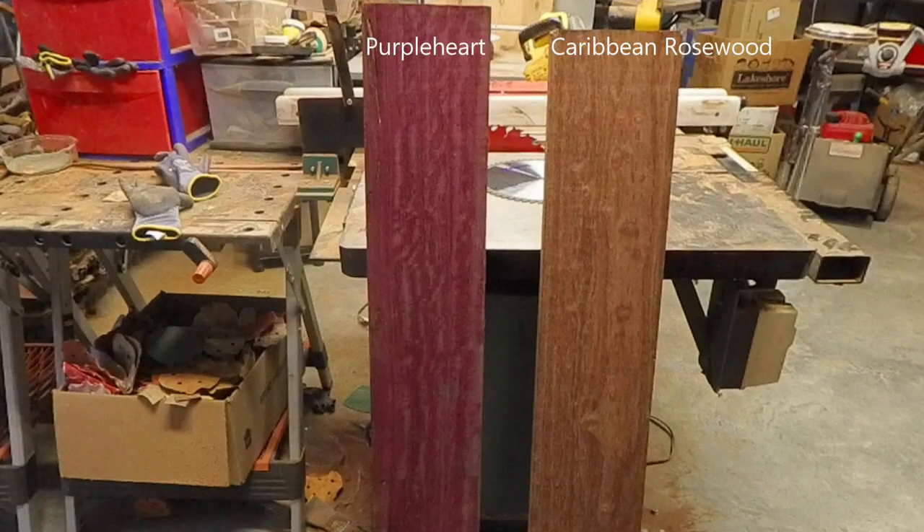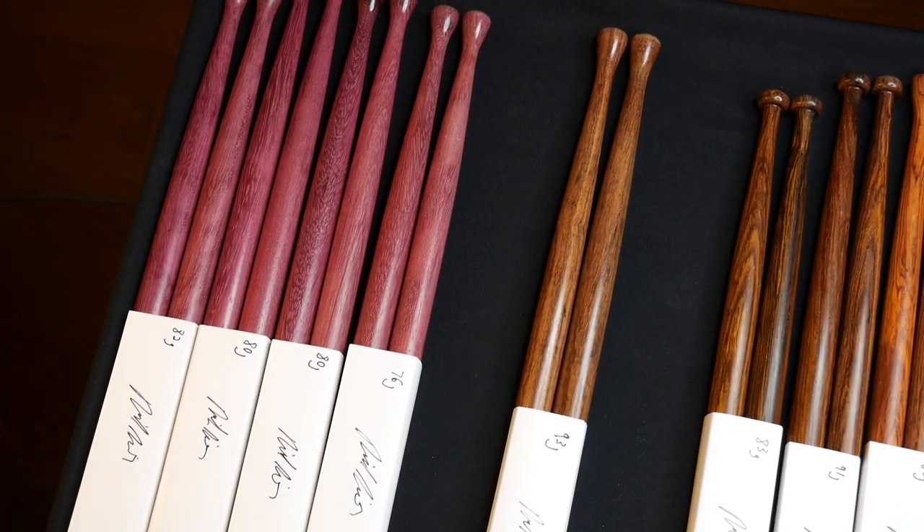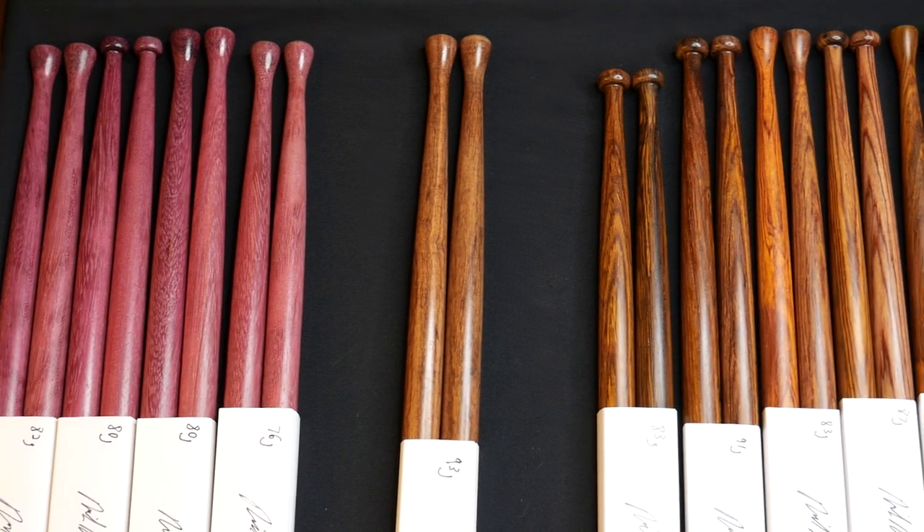Most of it's going to be about the same — feels great. Prior to using this particular batch of wood, I'd had some problems with purple heart with vibration, but this was really really good heartwood and it solved all that. So the problem was actually the wood I was getting.